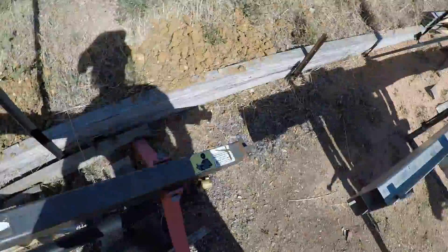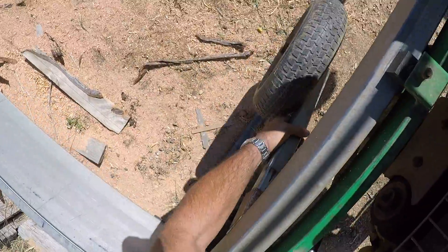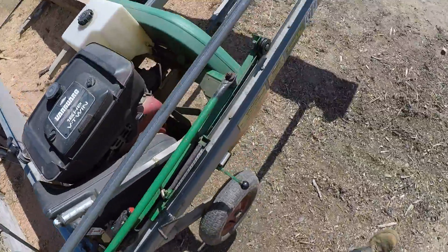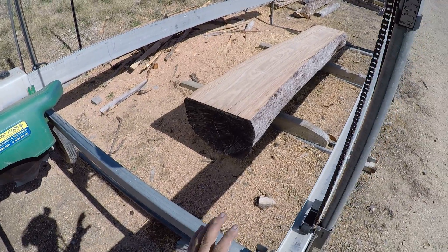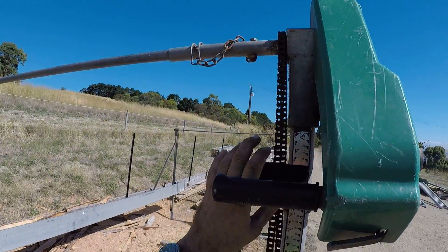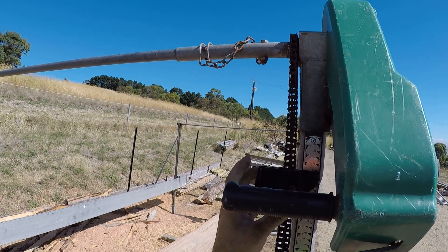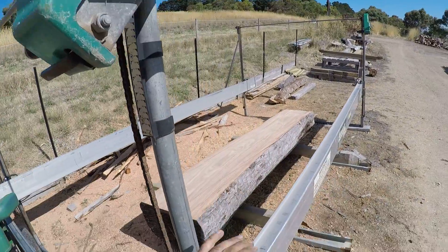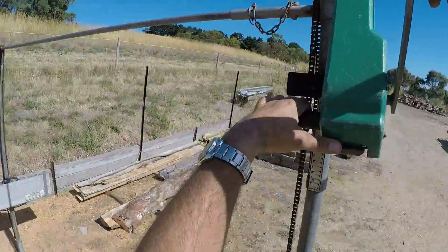What I need now is wheels. Get the mill so the wheels are going to go down in clear space. We've got a line now that we're cutting on — we've set this line and we want to use it through the whole log. So when we lower the mill and change the power heads, you want to come back to this line. I always keep the gauges at the top on the stopper — the depth gauge — and put the marker to the top as well, so everything is at the top at this level.